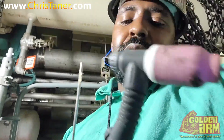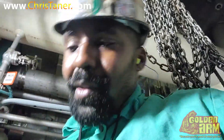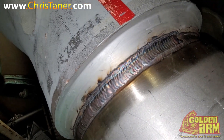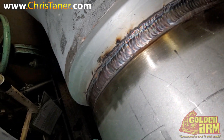The thing about that is you've got to be careful whenever you cut your heat really high using this 150 rig, because you can melt the block. On the end of the TIG rig you've got a block, and it'll melt the copper wire that's inside of this rig. People have a disaster trying to figure out why they can't get a connection, why they have no arc — and what actually happened is they melted the wire inside the TIG rig.